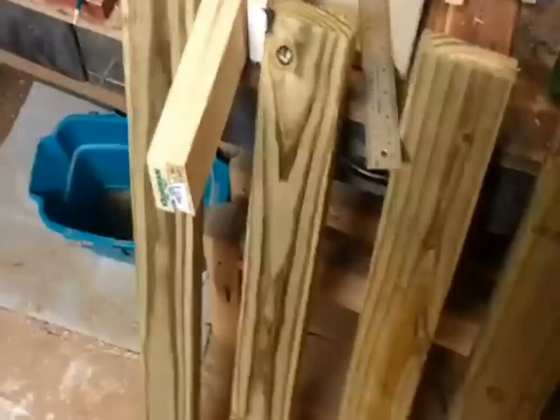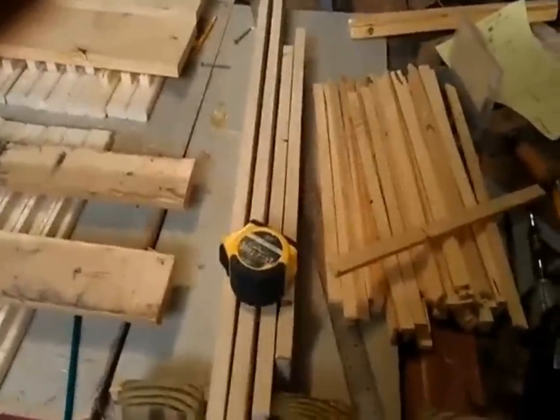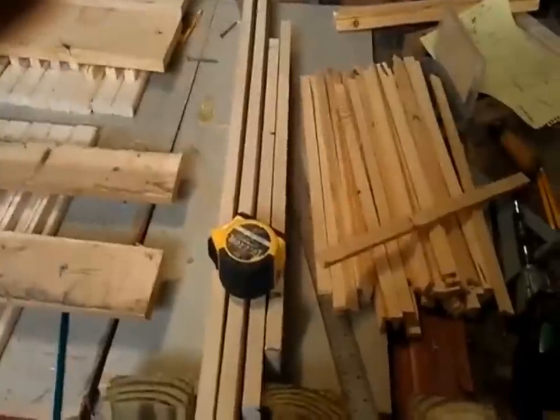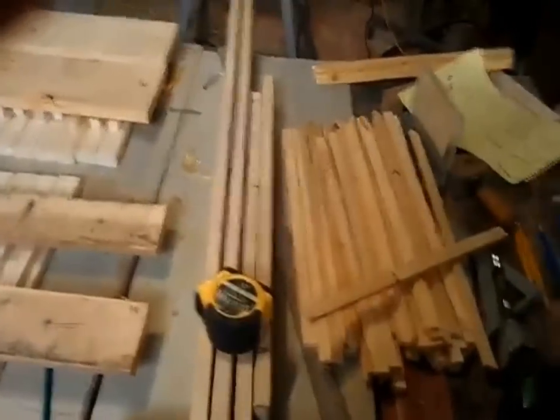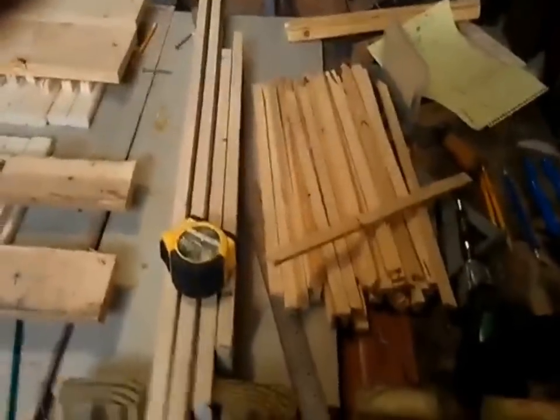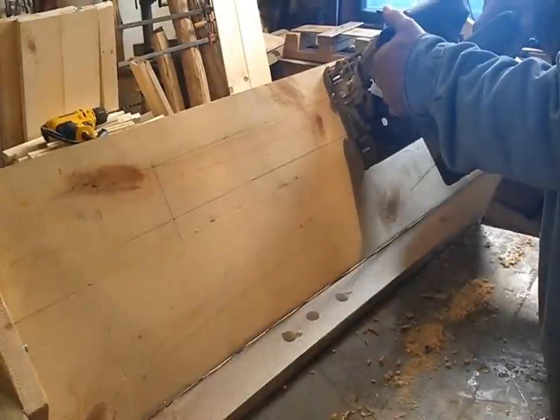This is the only pressure-treated wood: two-by-fours cut in half for the legs. The side pieces are 17 by 11 inches, so they're one-by-sixes glued and cut to 17 inches — you need two of those. The woods you want to use are western red cedar, Douglas fir, pine, or similar — I'll have that in the description box below.